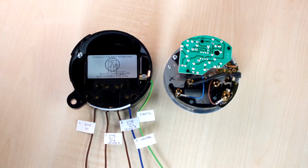Lastly, there's a special 4-pin time switch, model Q563. This has a changeover contact enabling you to switch between two outputs, for instance two machines. The wiring is therefore different to normal 4-pin time switches, and similar to the 3-pin, requires a common live supply to be used to operate the clock and also provide an input for the switching circuits.